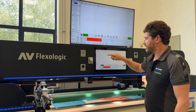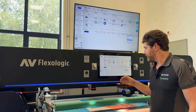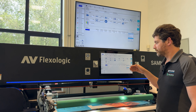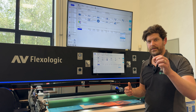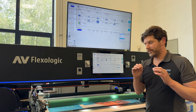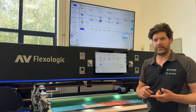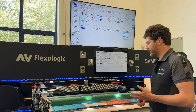How do we handle that in the job? Per specific plate, you can actually set the right recipe. That means the operator does not have to manually identify the plate type or mounting mark type. Without any alterations, it will automatically pick up and set the right lighting setting and the right shape of what to recognize.